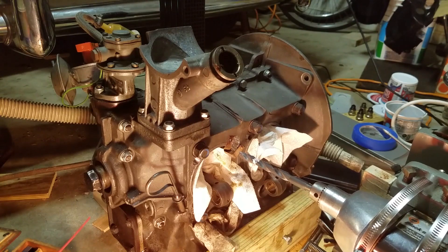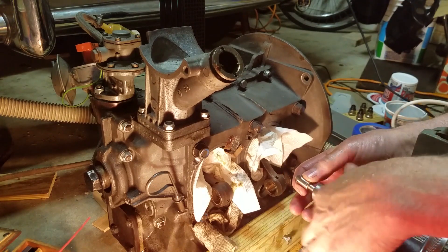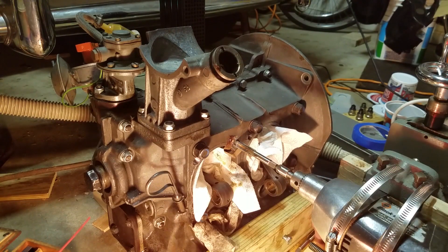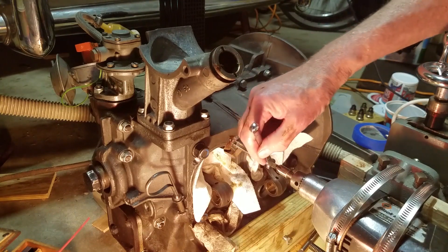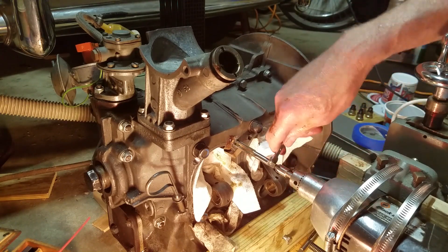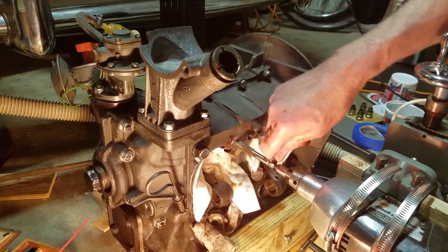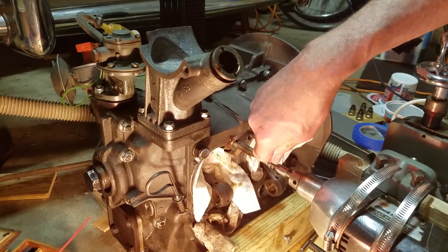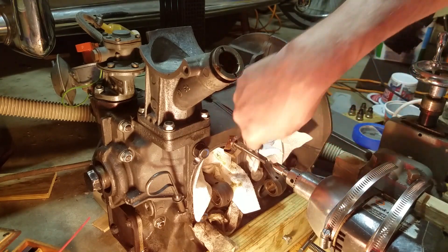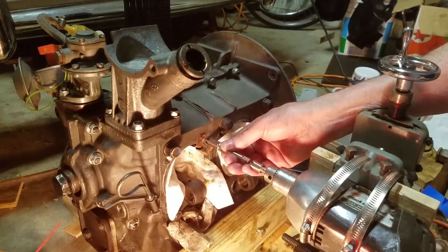The next step is very important. I back the drill out of the hole and, without touching the X and Z axis, I remove the drill bit and chuck in a countersink bit. I use the countersink to line up my ½×20 plug tap. Use a high quality new tap — don't skimp here, because getting good threads is very important. I also mark the length of the case saver on the tap so I can see my progress. I use a little wrench and the countersink to start the tap, with a little light lubricant — too thick an oil and you risk galling the threads. I run the tap in a little ways, then back it out to clear the chips, and keep doing that until I reach the case saver mark. Then I remove the plug tap and use a bottoming tap to finish the job.